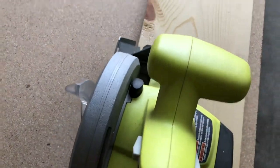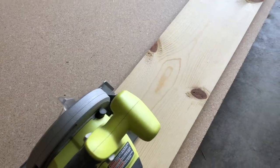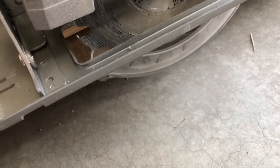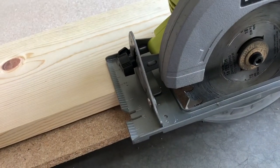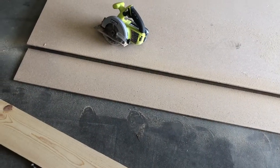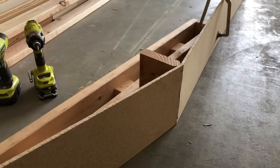I've decided to leave this long straight piece of wood on here and use it as a guide for my circular saw. I should be able to ride the saw right up against this piece and cut my straight line. I've moved the two-by-fours out of the way underneath and made sure the blade depth doesn't contact the concrete. There we go — I have my wood piece cut, and now I'm going to mount the center and wrap the wood around the edge.